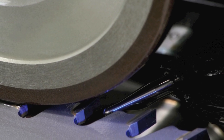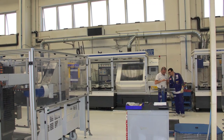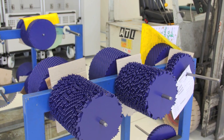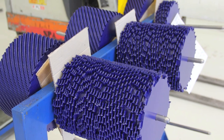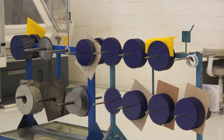Once this is complete, the blades are then sent off for sandblasting and a Teflon coating. The sandblasting cleans the brazing and the marks off the blade prior to the Teflon coating. The coating applied is that Irwin blue that we see — a heat-resistant, non-stick coating that helps reduce gumming and gives you a cleaner, more true cut.